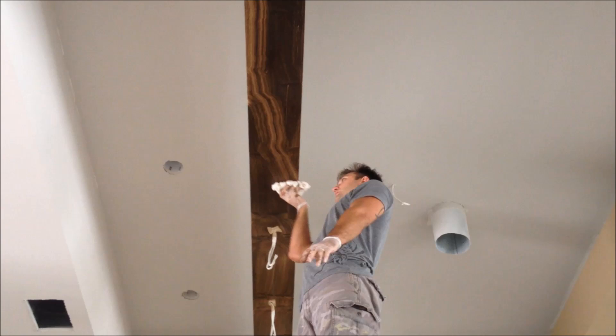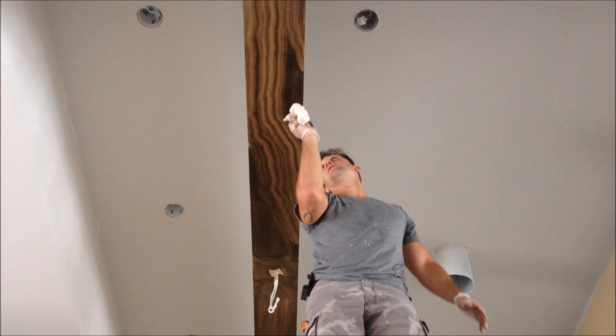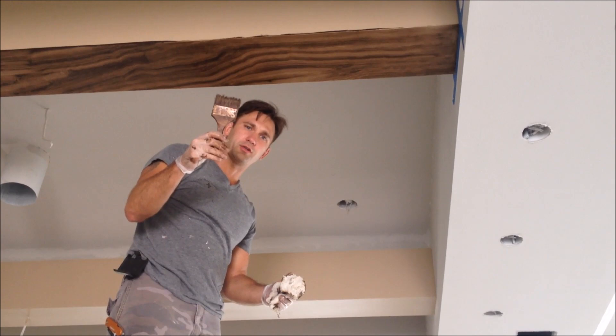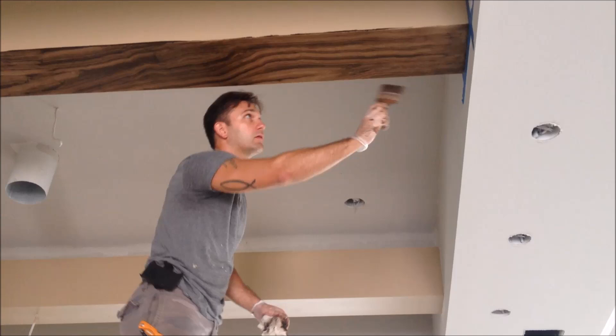It's as easy as that. And then you can get some other lines, things like this in there. The next step is to take a scumble brush and try to dry brush - rub whatever paint is in there. Just get a dry brush and then you want to move it almost straight, move the grain straight. Or you can fix some of the remaining grains - some of them are a little squiggly and too out of place, and the grain doesn't follow up.